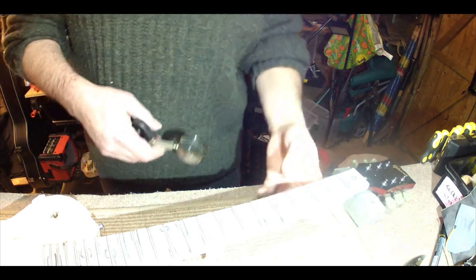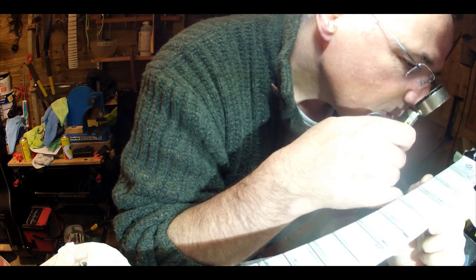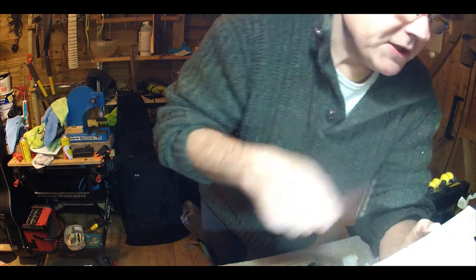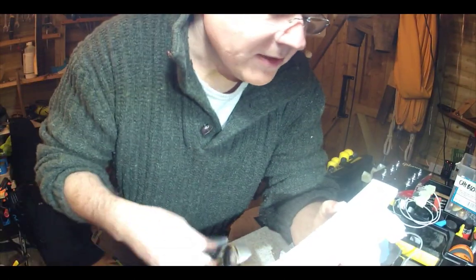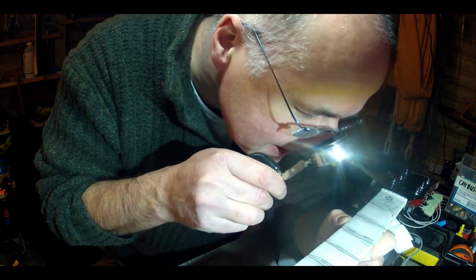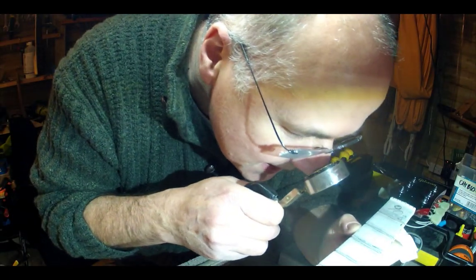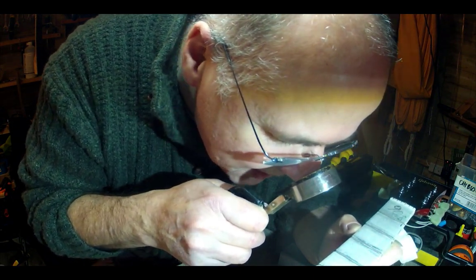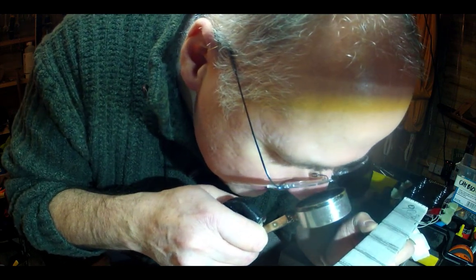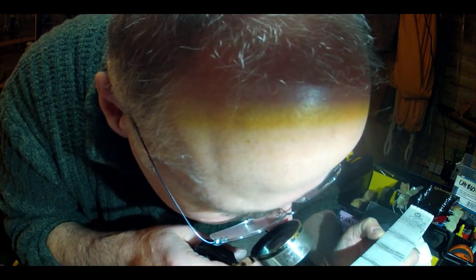So I'm just going to raise that up a bit. There's really no flattering way of doing this. So I'm just going to get right up close. And what I'm going to do is, if I see a scratch, I'm just going to mark it. And in doing that, I know at least where there is a problem. It seems really finicky to go back for such tiny little marks. They appear as tiny little potholes at this stage. They're running that way, lengthwise. And they stand out. They just look a little bit darker than everything else, so it's like a tiny pothole, and it seems like a lot of trouble to go to, but it makes such a difference if you take care of them now rather than trying to do it later.